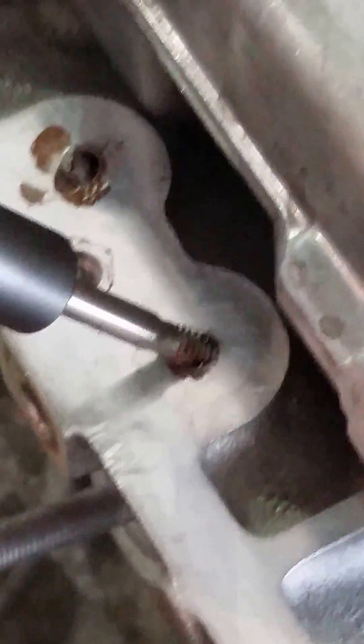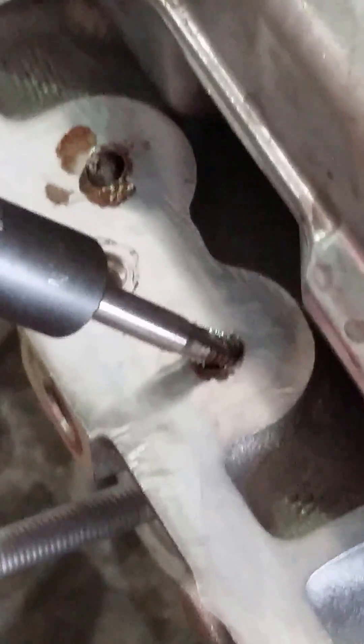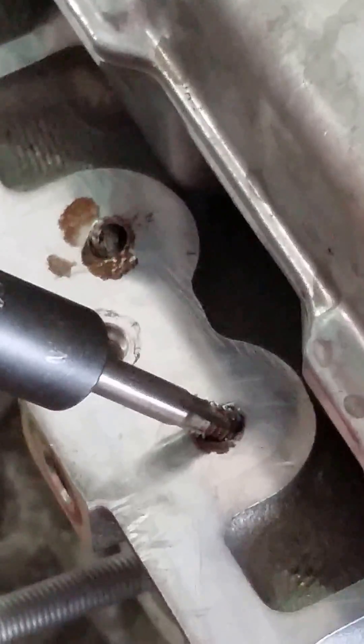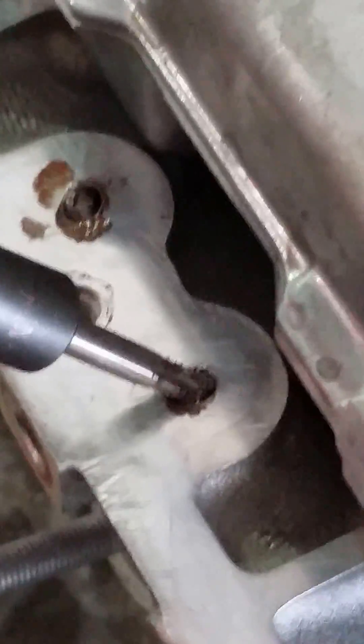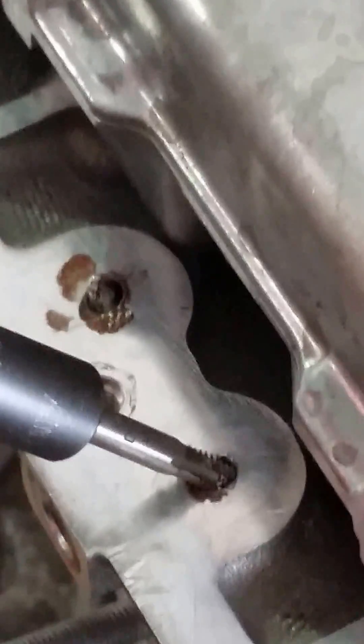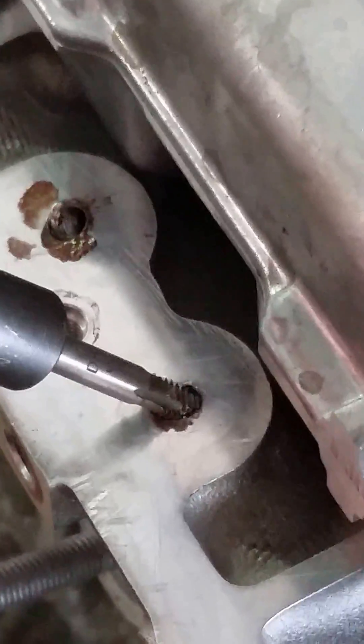It is not something you can rush or just breeze through. If you don't use a quality tap, you're going to have a broken tap and not have a good day. I'm using a little bit of anti-seize — really you need to use some type of lubrication. The main reason I'm not using actual tapping oil is because I want to keep the chips where they're at, wipe them out, put a little tape around, blow them out, and everything will be happy. So we just go back and forth — as soon as it stops, back off just a little bit and go back.